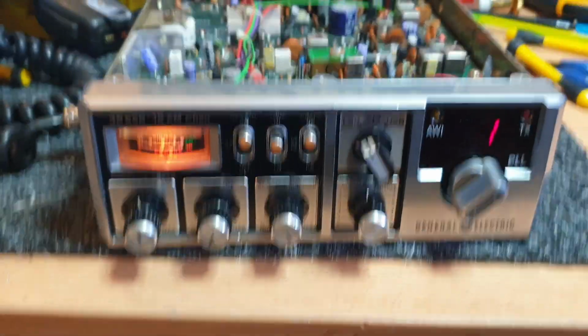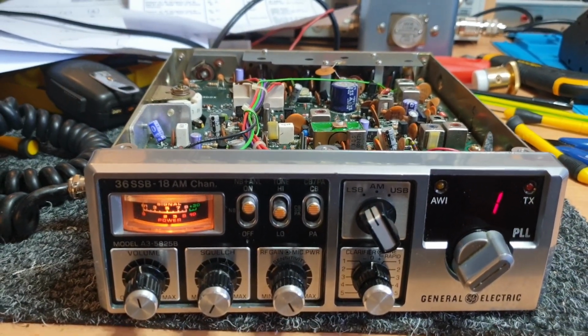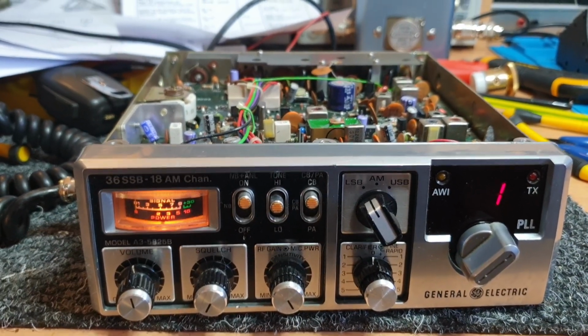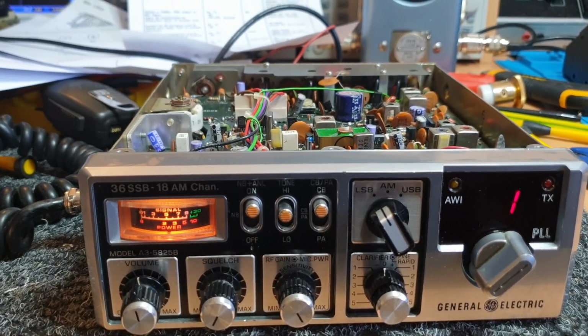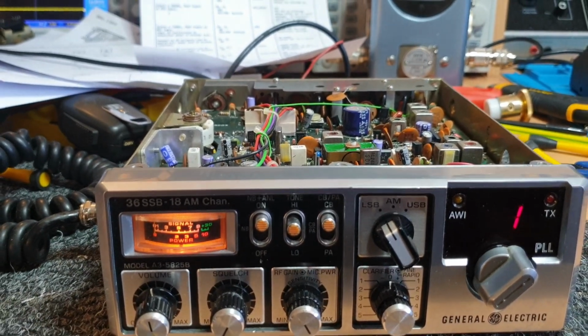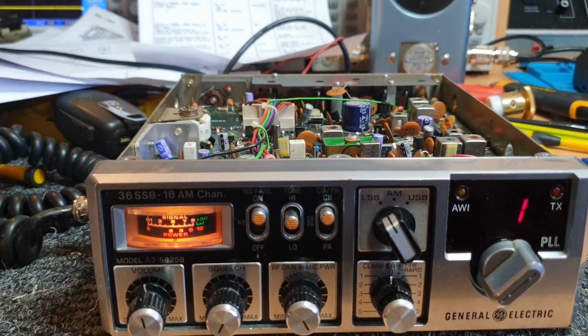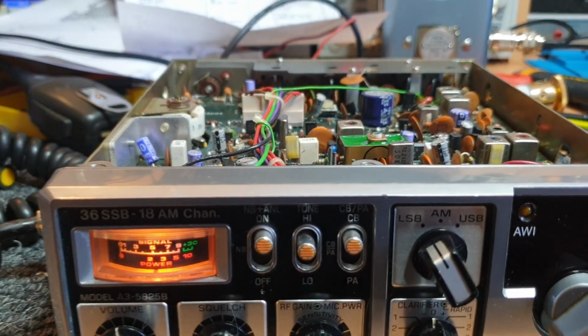Okay, I'm a bit of a perfectionist. Don't ever be scared to pull the covers back off. I know what it's like to have that finished feeling, but when you notice something that's not right, hit it. And I'll tell you what wasn't right was my carrier balance. What I was saying was overdriven. I thought, hang on, let's just have a quick look on the scope. And yep, sure enough, my carrier balance wasn't 100% right.